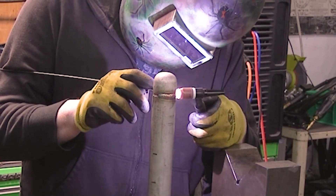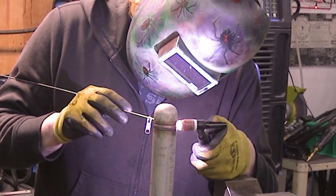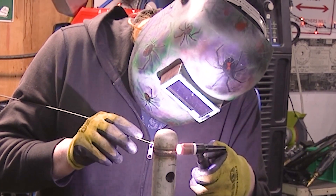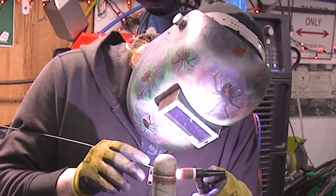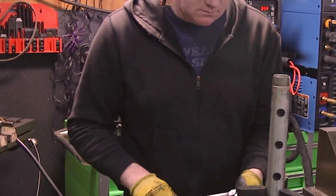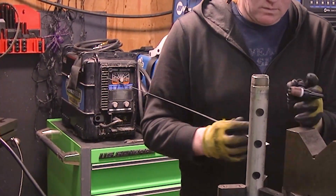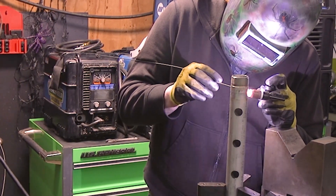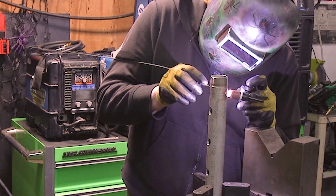I'm running about 85 amps or so. I might have gone a little heavier on the fill pass here. I really like the push button for welding pipe like this because you can just set your amperage, hit the button, and it does the high frequency start. You can even set your ramp up and ramp down times if you need to mess with your amperage. Pretty much 85 amps was good for this and just kind of let it rotate. I did have to tweak the speed at which my part was rotating, but as you can see here it works out pretty well.